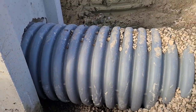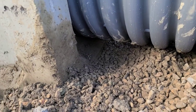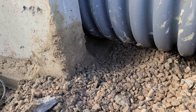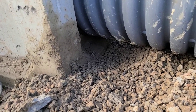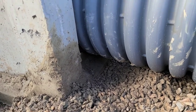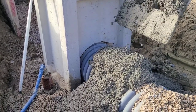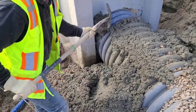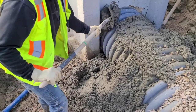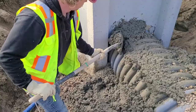What we need to do is make sure that we have a clear path underneath the pipe — a good six inches — so we can get concrete to seal all the way around the bottom. Once we pour concrete in, we're going to use a vibrator stinger to get concrete to flow into every little spot.